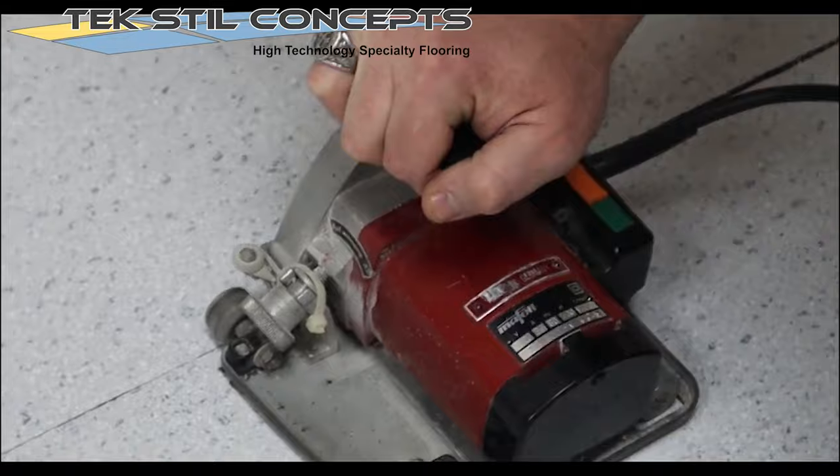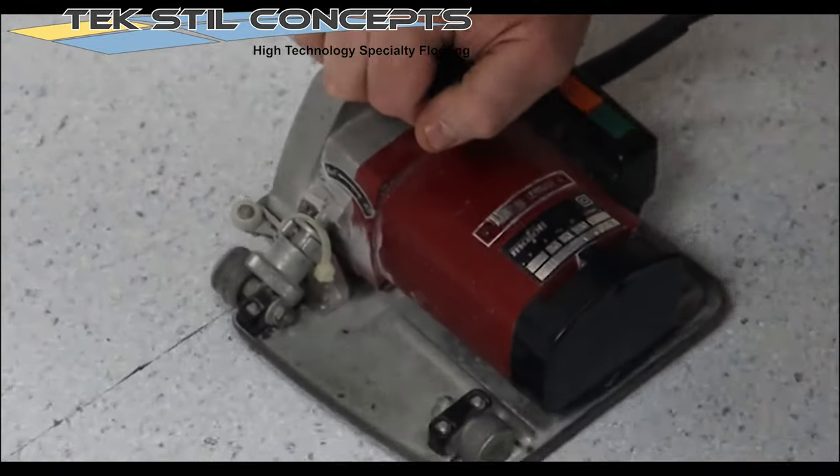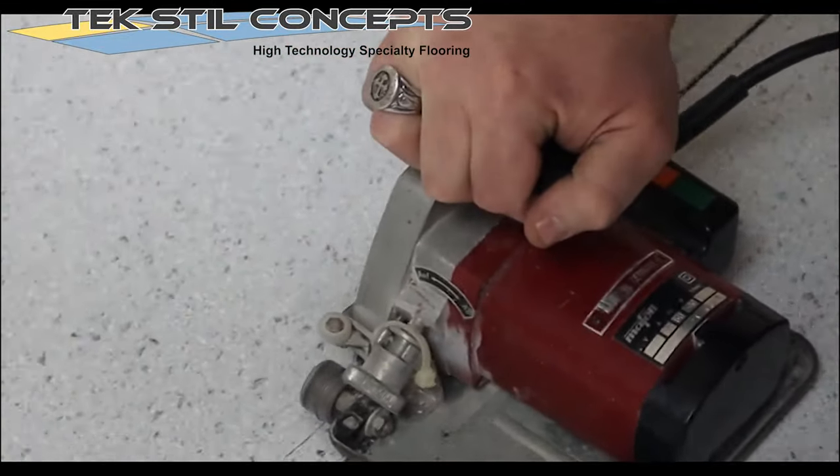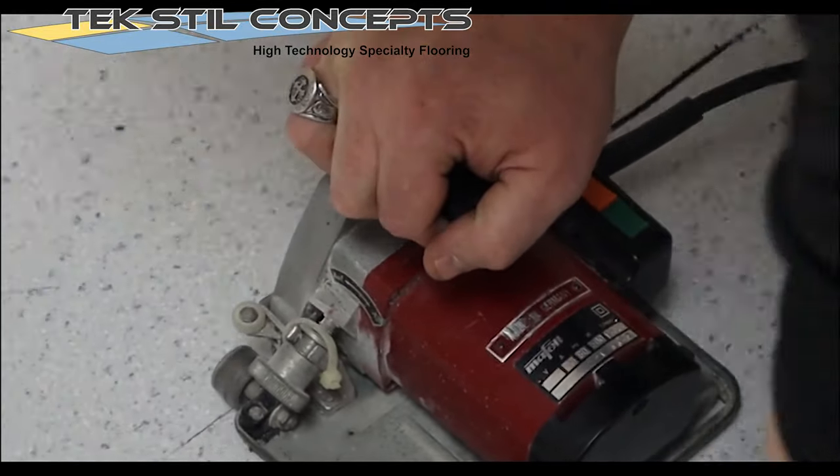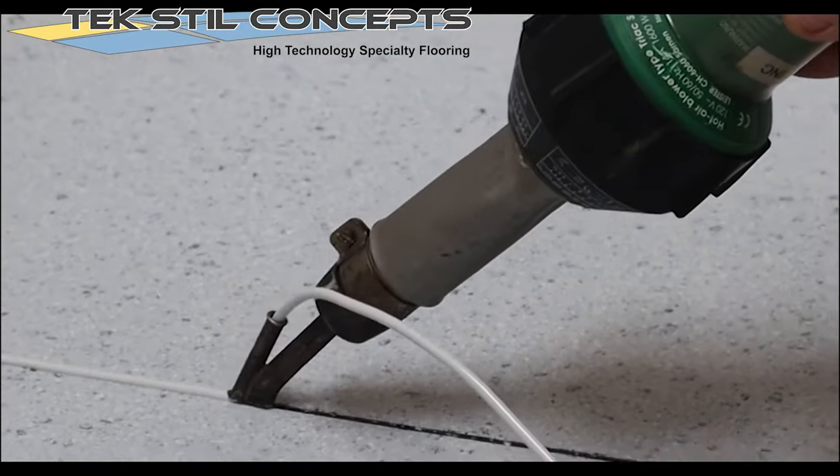After waiting for at least 24 hours, the seams will be ready to be grooved and heat welded. Use excess sheet vinyl to adjust settings for the groover and the heat welder prior to working on the installed area.